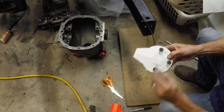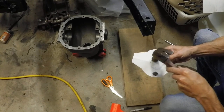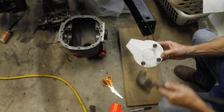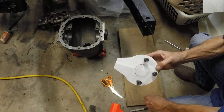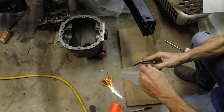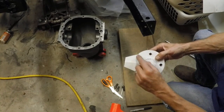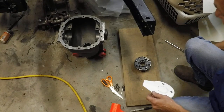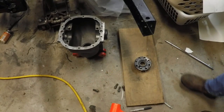There are several ways to do this — there's not a right or wrong. When we cut this center out we're going to cut it proud so it comfortably fits on there, and then we'll sort out the half-inch hole — we won't cut that here, we'll just cut that on a plate later. We'll be ready to go. And when we cut that out, we're going to fold it in half again and cut two sides together just because it's easier. It's yet another tool template to cut. I think I'm going to make this at quarter-inch steel — that's the thickest I have, but it'll be just fine.